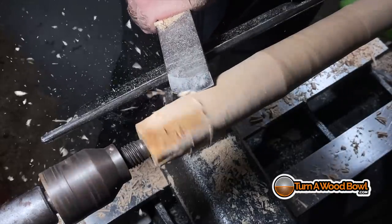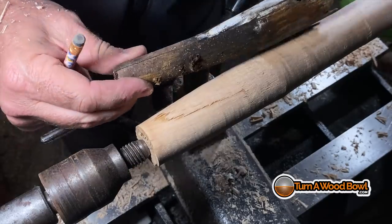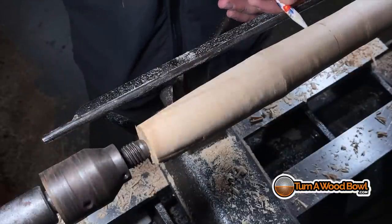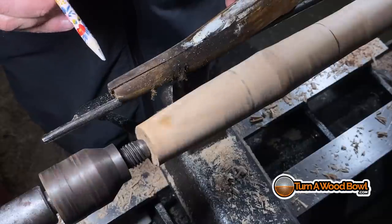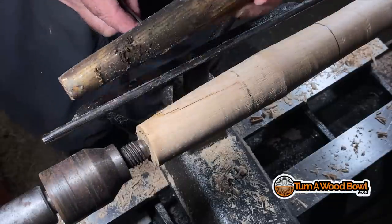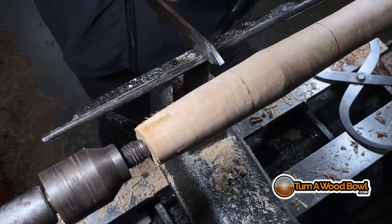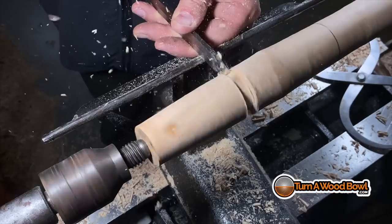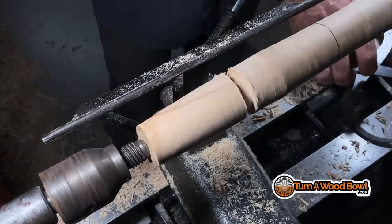Now I'm going back to a slicing cut because this wood is dry and brittle. If I tried to scrape it, it would damage the wood — take out big chunks. I'm using that piece I took out of the shovel and taking direct measurements off of it: the length of the piece, and then the width at about the center portion. Ideally, if this is done right, the end of the shovel handle will fit right into the shovel itself. A peeling cut has the parting tool tip pointed up and the handle pointed down, positioned at an upward angle to the wood.